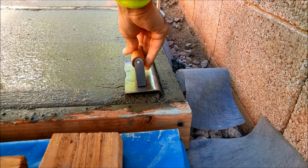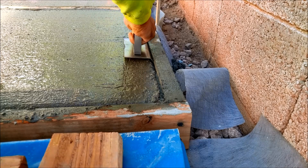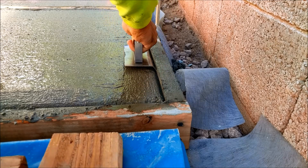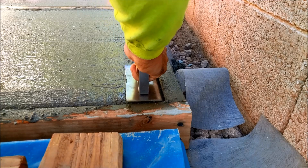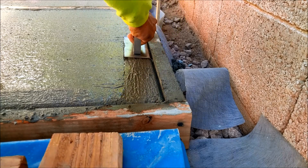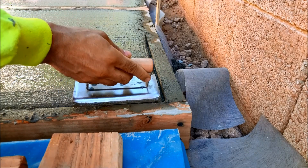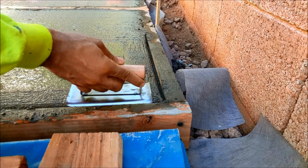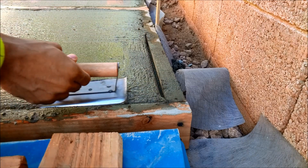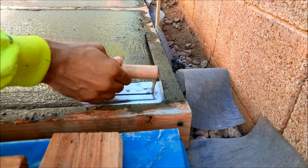This is a close-up of the corner to show you how to get the corner to be sharp, just like the edges. It's important you don't press too hard, as you could start depressing the concrete and pushing it away from the corner, changing the level. Evenly slide the edger back and forth and you can bring extra concrete to the corner by gliding in that direction. If you happen to have rocks sticking up, just vibrate the edger until the rocks sink back down.